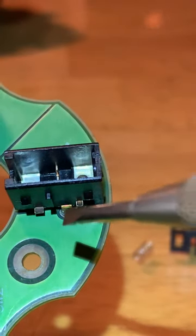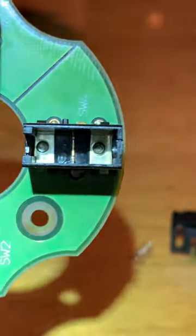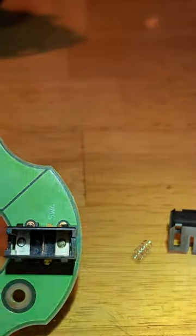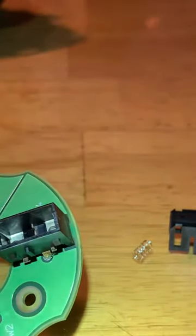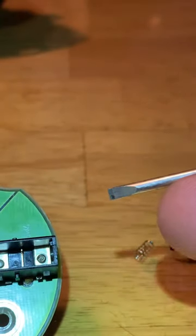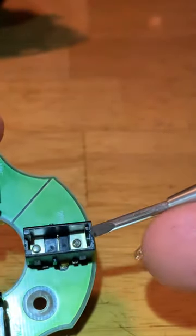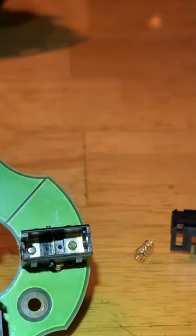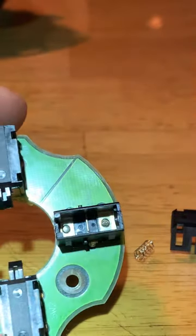For cleaning it, I would recommend buffing it. Judging by the color, it's silver — these are silver plated. So maybe alcohol, or try polishing it. I did scratch the other one — I actually used the screwdriver tip to proof it out, lightly scratched it, and it came clean. The carbon came right off it and it worked. For me, that was a 100% solution. Don't know how long it's going to last, but cleaning the contacts definitely resolved the issue.